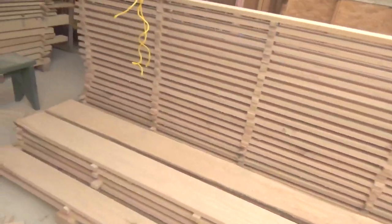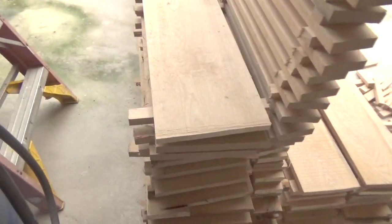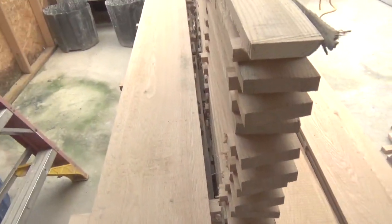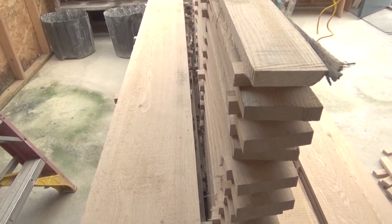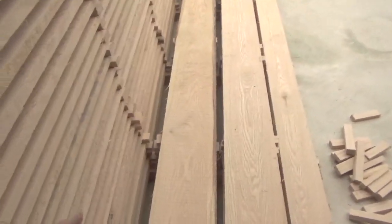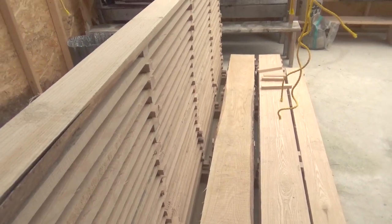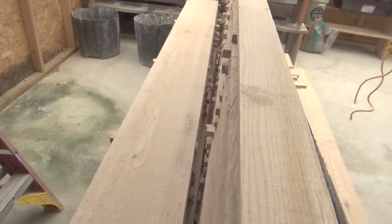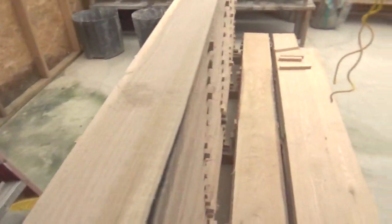I'm showing you what I'm doing here in stacking wood. Normally I would stack this in a four-foot-wide layer, but what I decided to do was cut short stickers and put them between the boards. I don't know if this is going to affect this wood in any way — I know that wood piles tend to fall over as they warp and move. I'm thinking that if I get these 1x12s up as high as the 1x4s and the 1x8s up as high, at least the piles stay together. They're staying pretty nice though — just the fact that those 1x4s can stay stacked that high without falling over with nothing holding them but themselves. This is how I'm going to stack this: 6s, 8s, 10s, 12s, and 4s — so I can get at them when I need individual pieces.